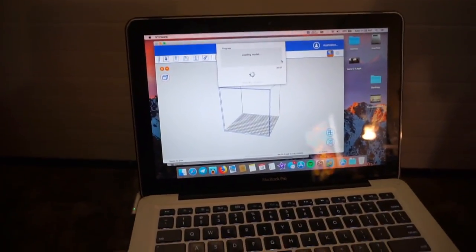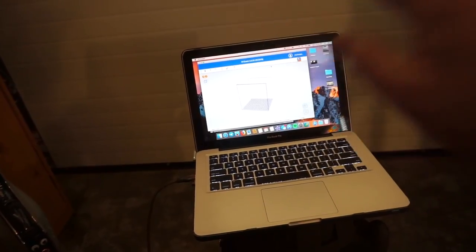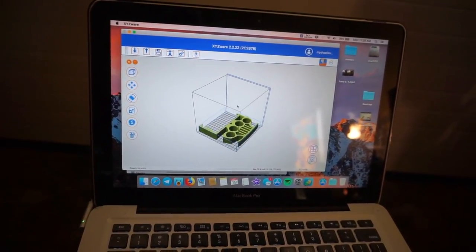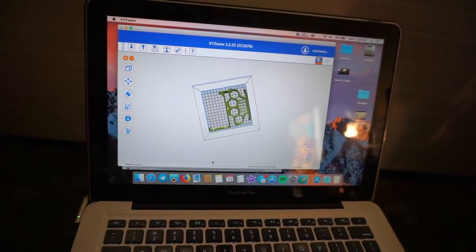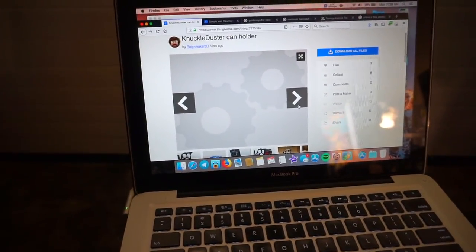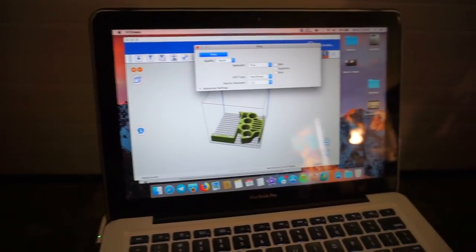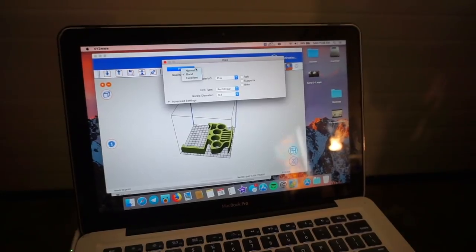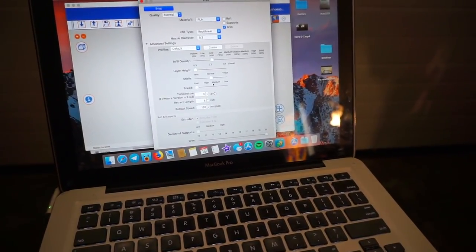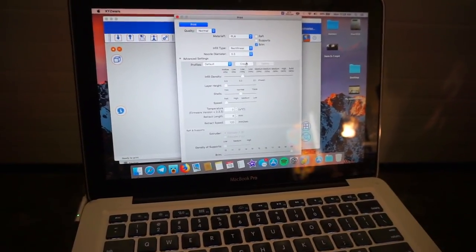My breakfast is getting cold. Anytime now. Well, while this thing is processing — the software is terrible. It was ported over from Windows and it doesn't work with macOS very well. There we go. So this — I know you can probably see it looks like brass knuckles, but can you tell me what this part is down here? I'll give you a hint: it's a knuckle duster can holder. Isn't that sweet? So yeah, we're making that. Okay, so settings — this time I think we're just going to go normal mode. I'm going to have it print a brim, which should help it adhere to the glass, make the brim as large as it'll go. We'll do low infill — this thing's going to take like three hours to print.